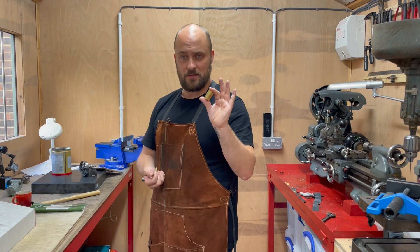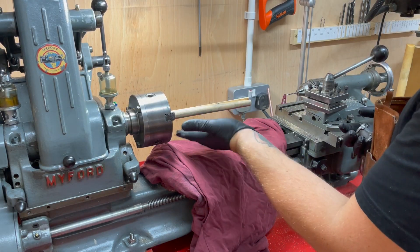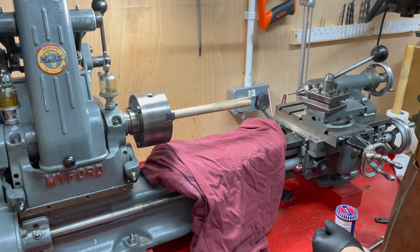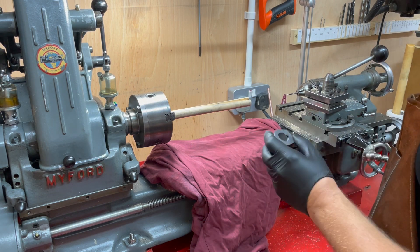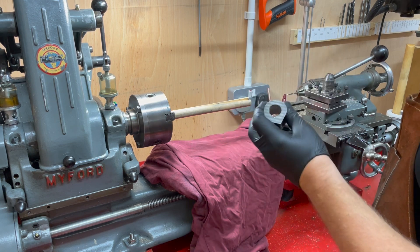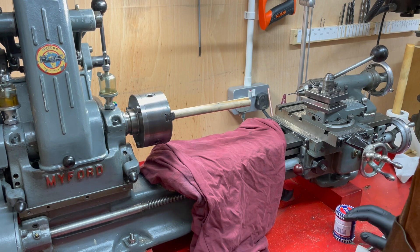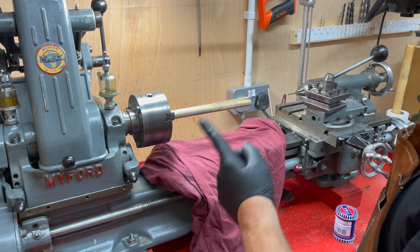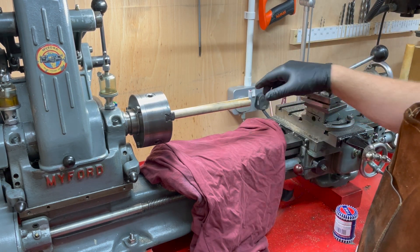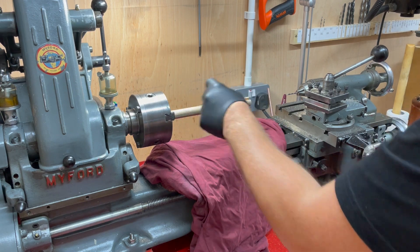The first thing to do is the piston. I have a piece of wood in the three-jaw chuck and a t-shirt on the ways. While machining the piston, which is part way done, I realised I hadn't lapped the cylinder, which might change the fit of the piston in the bore. I figured it's probably a good time to do it now. So rather than using the cylinder hone that you get attached to a drill, which I did buy thinking it would make life easier — and in fact it's the wrong size — I'm going to be using grinding paste on this expanding lap.